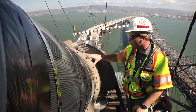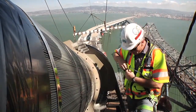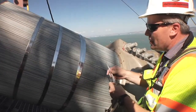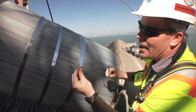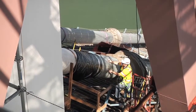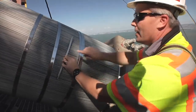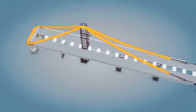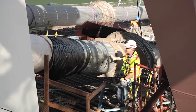We coat bay to bay between these individual cable bands all the way down the cable. And then on top of that, we have this, our S-wire wrap. Basically, the S-wire wrap is laid around the outside of the bridge. And this one actually has notches in it so that it interlocks and can slide directly in. So that wraps around the outside of the bridge like this, all the way bay to bay between these cable bands. And then on top of this S-wire wrap, we have two coats of a Noxyde based paint that almost form a gasket on the outside of this S-wire wrap. Two additional coats of paint are put on the outside of that.